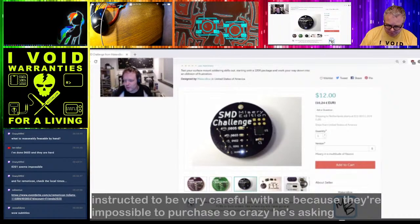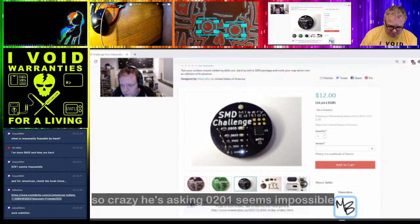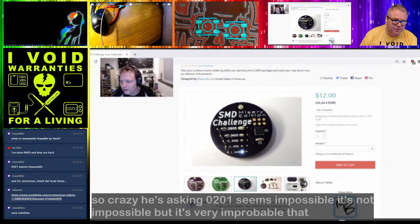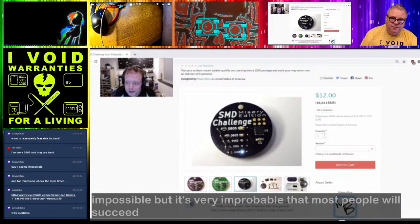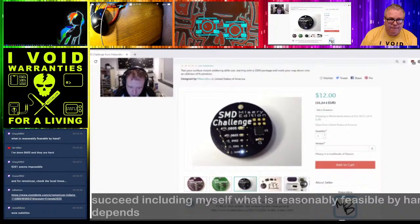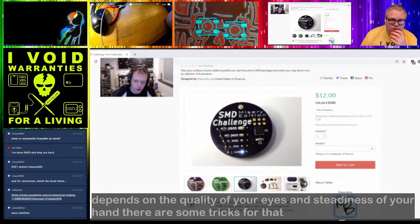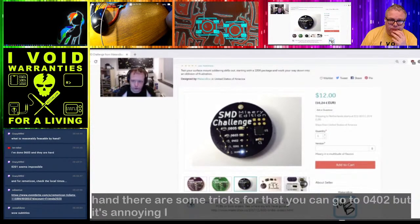0201 seems impossible. It's not impossible, but it's very improbable that most people will succeed, including myself. What is reasonably feasible by hand depends on the quality of your eyes and the steadiness of your hand. And there are some tricks for that. You can go to 0402, but that's annoying. I stop at 0603 for my designs.